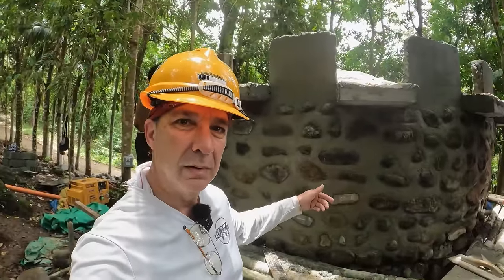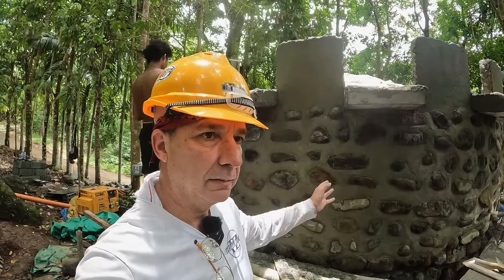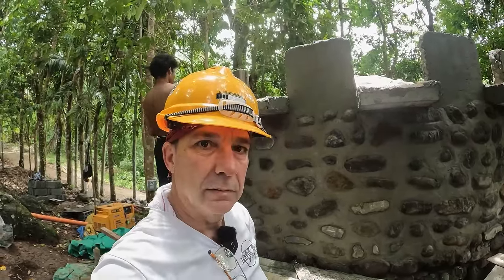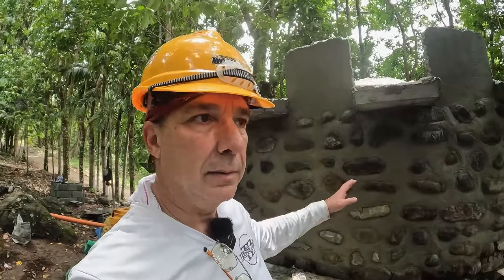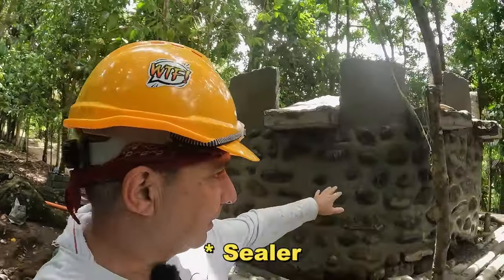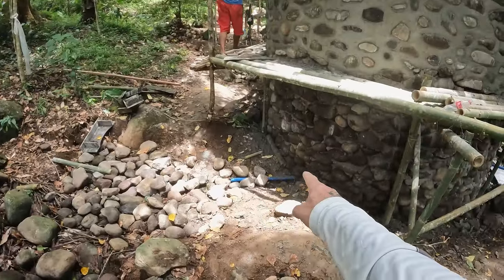Here's the roof — they searched for flatter stones and laid them on top of the concrete, then plastered that in. It's semi-smooth to give rain an easy path to exit off the scupper drains. I was first thinking to just leave the stones exposed, power wash them to get off the excess cement, and let mother nature do its patina — some moss and stuff. But what they did looks pretty cool. I'll still power wash it once it sets, then either let nature do its thing or hit it with a solvent-based clear lacquer to give the rocks a nice shiny appearance and aid in waterproofing.